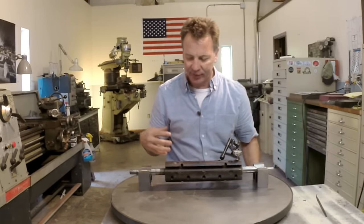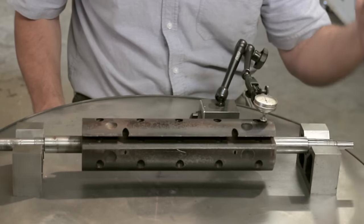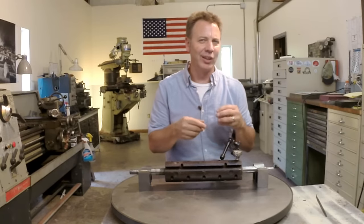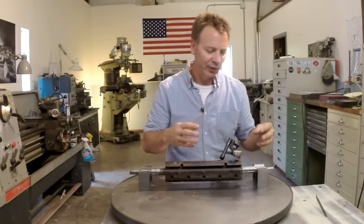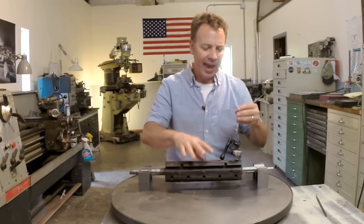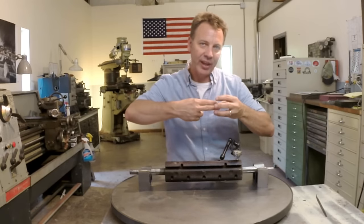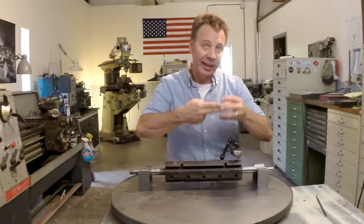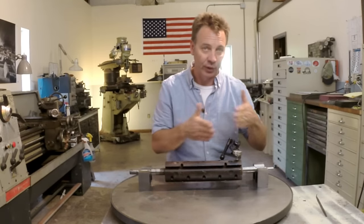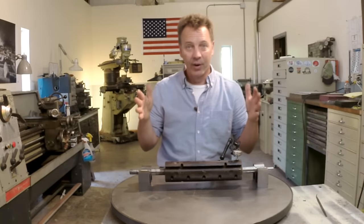By testing this out, what I think I'm going to end up doing is coming in here with a collet — not a four-jaw chuck, but collets. Collets are excellent. The ones I have here are all Hardinge, but they're old, a little worn, a little out, and we're going to leverage that on this machine. When we put it in, I know it's going to be out probably about a thousandths, and the shaft itself is out probably about a thousandths on the bearing surface. So we're going to rotate it inside the collet until we find where it's centered and concentric to the rest. I'm going to give myself a tolerance of about a thousandths of an inch, which should be good enough for this machine.